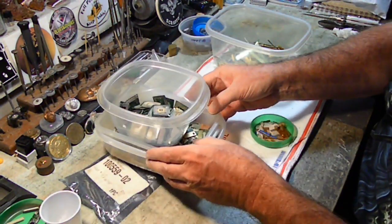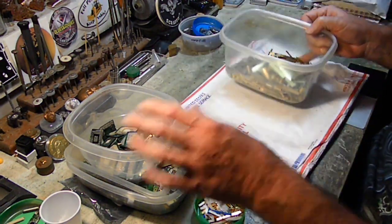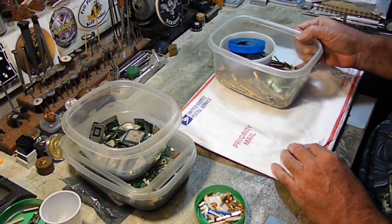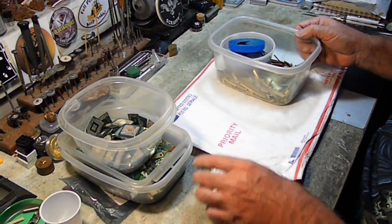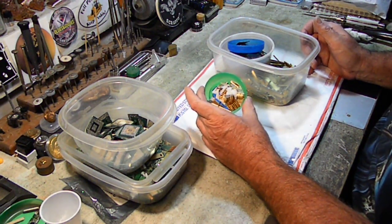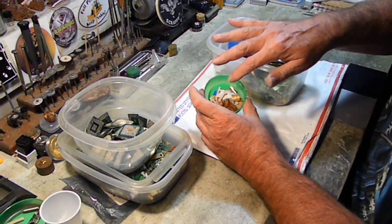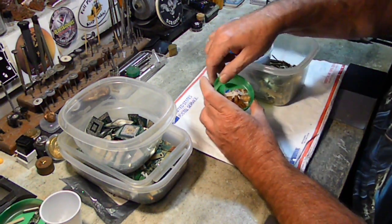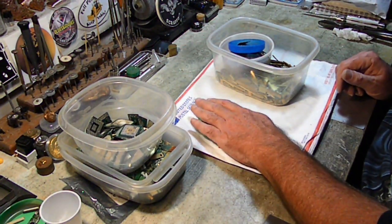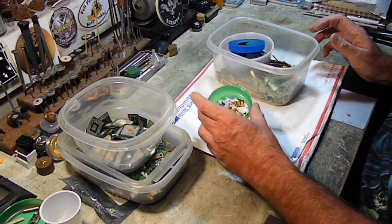We're all separated out. This material, this material, and this material are going to be returned. Another reason — if you're going to send something, you want to know what to send, because this all costs money. There's half the weight of what we're going to do right here going back because it's not feasible for me to process this. These printer ribbon cutoffs I'm actually going to send back to them in another little bag, because this is good stuff — but the way I process this is different. If you end up with a couple, three ounces of these ribbon cutoffs, you're going to have a nice bit of gold return. Just keep building up just this stuff and send it when you get a nice little sandwich baggie full of it and you'll get some gold back.